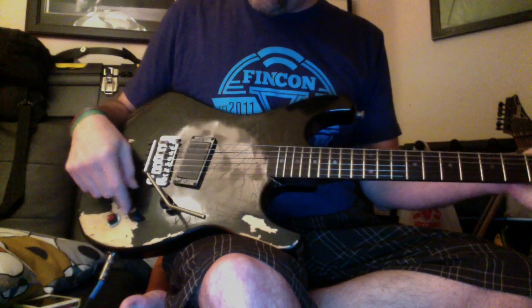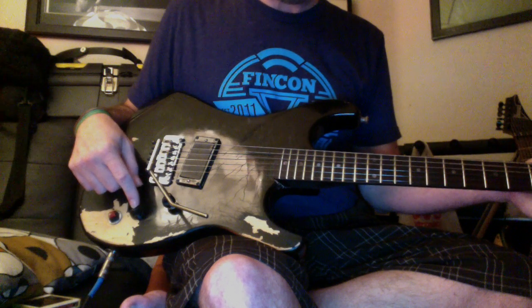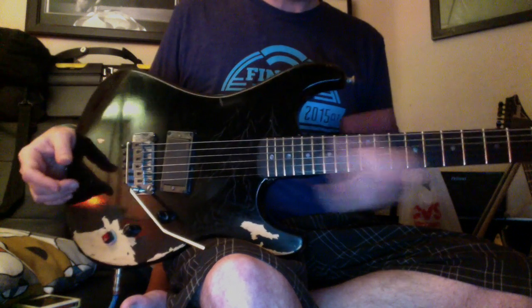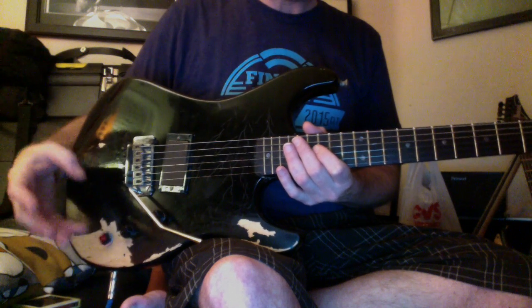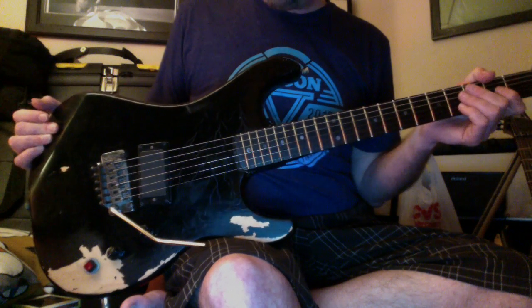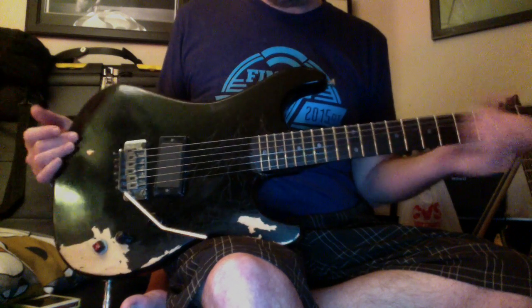The other thing is that there's a tone knob here, obviously. This tone, though, is very subtle. It's got a Sprague orange drop cap in it, and it's just meant to color the mid-ranges. So it's not like a traditional tone control where you turn it and you hear the whole thing go muddy. It's only really adjusting the mid-range and coloring it, and you notice it really on the distortion and high gain settings.